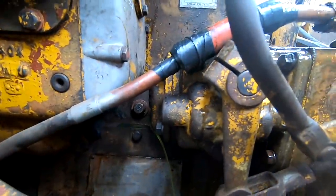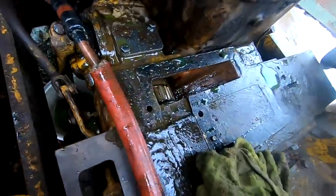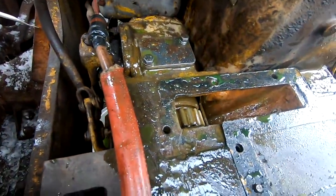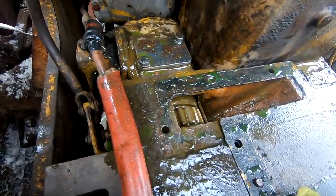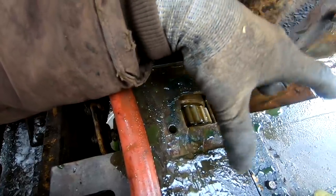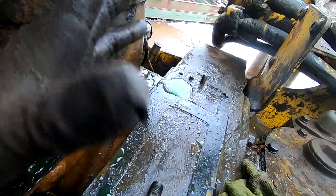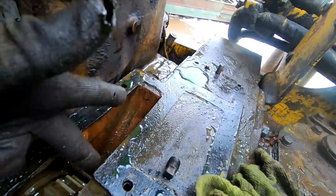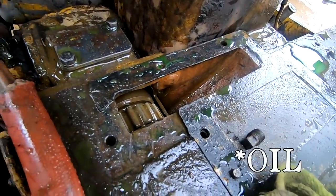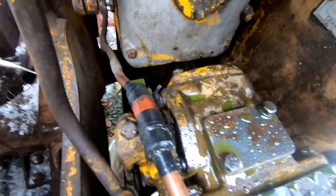So, because I didn't drain the coolant, it filled up this little area where the clutch housing is, and that's where you saw the oil and the coolant mixing right in here, because this area doesn't normally have coolant. But when the coolant came out of there and overflowed this whole area, it filled up this passage and drained all the water out of the clutch housing. So I drained the whole clutch housing, got that open now.